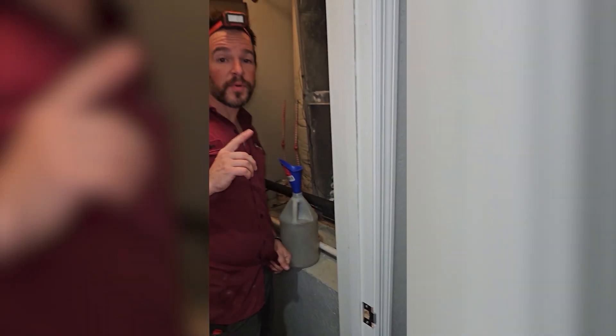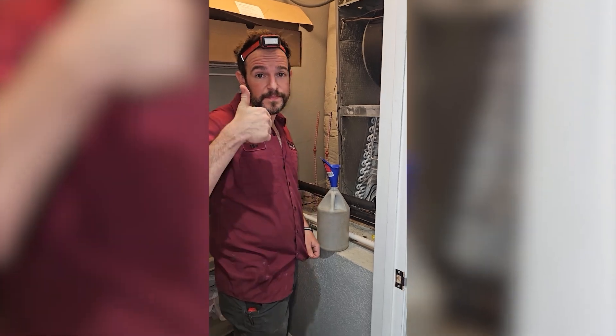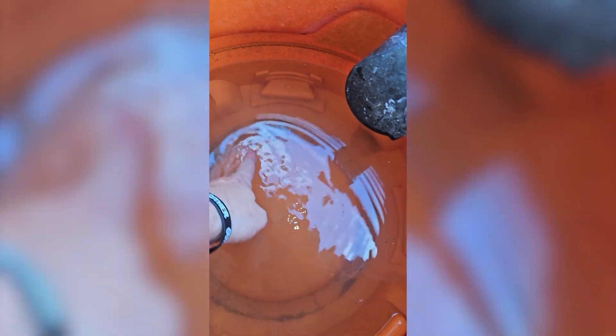I'm going to go get more water. We're going to keep flushing this until it comes out clear. You can see we got some sediment out of there — some of that's dirt from cleaning the condenser. Not a whole lot of scum, but we'll probably give it one more for good measure. Make sure it comes out clear and then fill up our trap again.